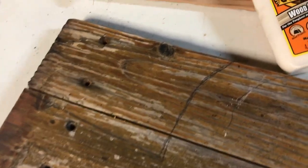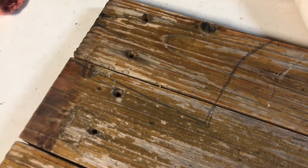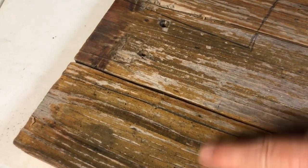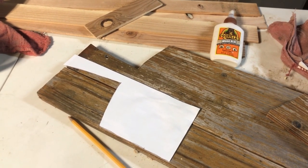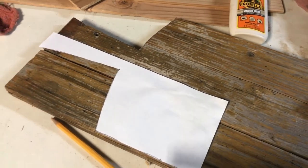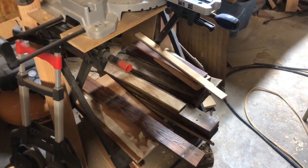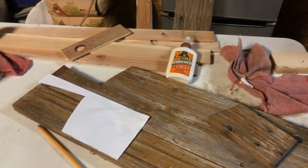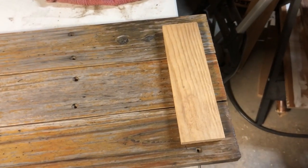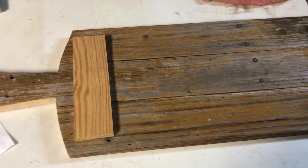I've come up with a design — I drew it straight up and I'm going to cut these off, then use those pieces to get the other side the same way. I went ahead and made a pattern, traced it, cut it out, and put it over on the other piece. Since I have quite a few more slats, if I like the way this looks, I'll have the top pattern ready to reuse. I've got it all cut the way I want, cut some little slats, and I'll glue it in between with some brad nails.